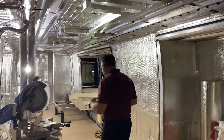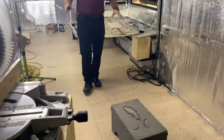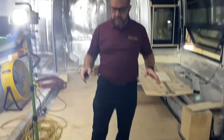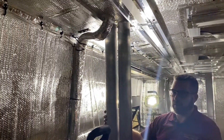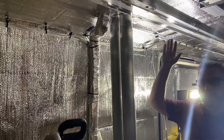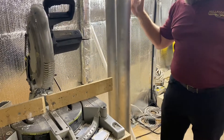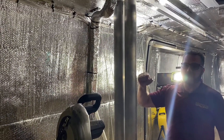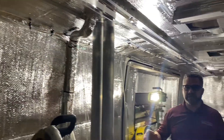The guys have marked the flooring so we have a layout of where everything goes inside the coach, giving them a reference point while building. Right here folks, this is our generator and AquaHot exhaust. We exhaust both through the roof so it gets that heat and smell up on the roof instead of outside when you're trying to live and enjoy life outside the coach. There's actually another pipe inside this solid pipe that's the actual exhaust, and these are heat shields to protect it inside the coach.